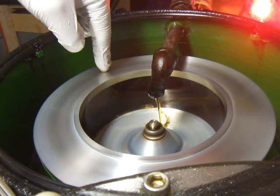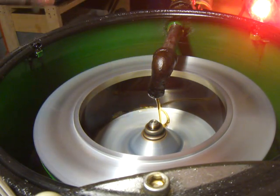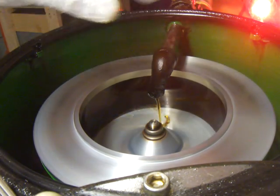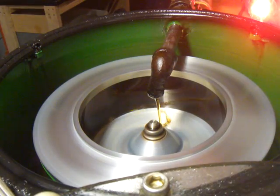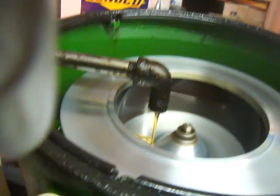I'm going to touch right here and you'll be able to see the oil spray up. And that's where all the clean oil is. See the clean oil coming off my finger. And over here on this side there's now clean oil coming out. And that is how the centrifuge works.